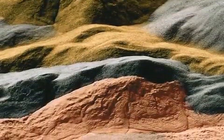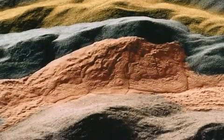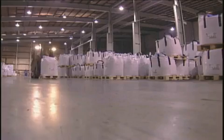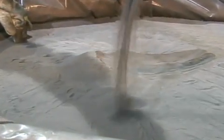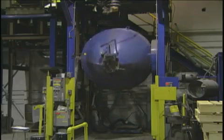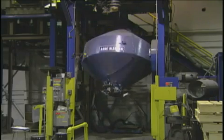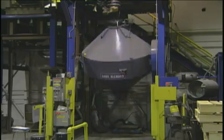It all begins with metal powder. Produced through a variety of processes, depending on the metal involved and the specific microstructures and properties desired, the powder arrives at the part fabricator's location in bulk containers. Alloys are produced through one of several techniques, such as pre-alloying of the elements in the molten state, diffusion bonding them during the annealing stage, or mixing them in special devices to achieve a certain degree of homogeneity. A small amount of lubricant is typically admixed with the powder to alleviate the frictional forces inherent in the process.